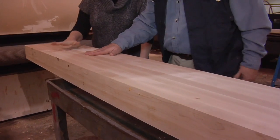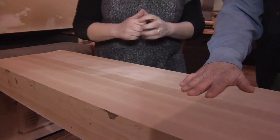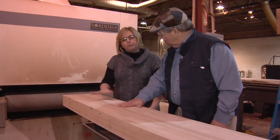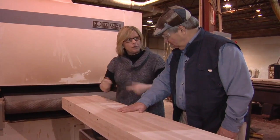The maple, being such a hard wood, has to be sanded with a little bit of finesse. We have to get it to 1/16th at the pass, whereas a softer wood we can pass through once on each side.